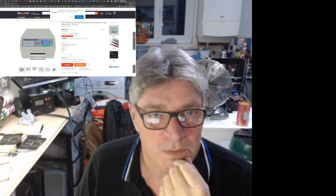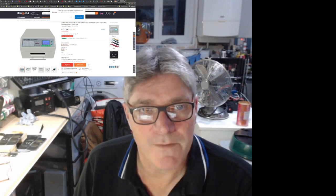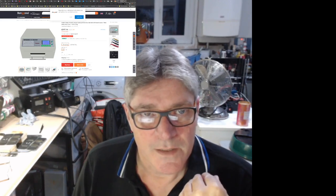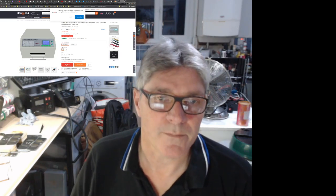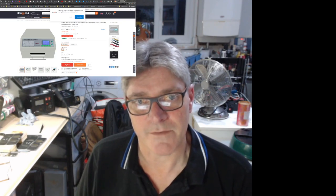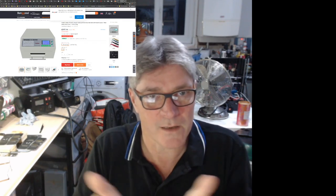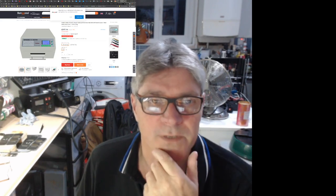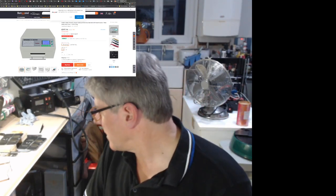And there are other mods you can do as well, which is what I'm kind of experimenting with at the moment. You can control the way that the air flows. There's a cooling fan in there, and that's really bad because it blows directly on the board. Basically, the reflow profile diverges a lot between different points on the board. So you can improve that by changing the way that the air moves, among other things. You can also add, I believe, baffles, so that the elements don't have such hot points where their combined infrared beams meet. There's all sorts you can do. I've seen all sorts of videos on them, ways of improving. Anyhow, mine is currently being modified, let's say, which is why I'm having to use the hot plate.